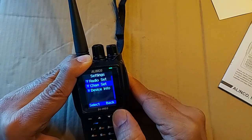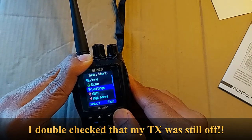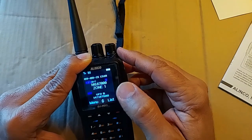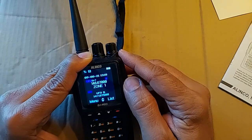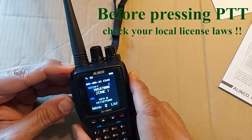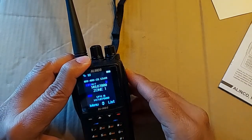There you go — Morse code CW coming in from the repeater. Somebody must have just keyed it, as they call it. So I could just sit here and listen to the repeater, and that's what you want to do for a while — listen in, make sure no one's talking. Once you're ready to transmit, use your push-to-talk key, push that, wait a few seconds for the repeater to wake up, announce yourself with your call sign, and see if someone responds. Hopefully you get your first QSO.